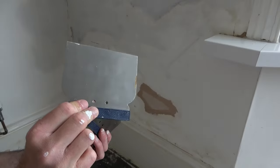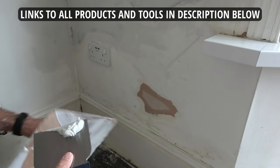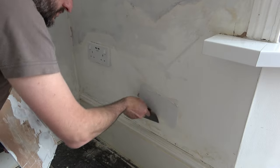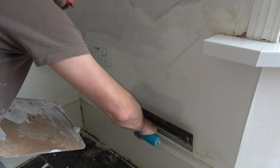If you've got a smaller patch of wall to repair then you can just use a smaller set of filler knives like these — I'll put a link to these in the description section below. You use these in very much the same way as the trowel, just removing the filler from the hawk and spreading it across your damaged section of wall. Again, your damaged section will ideally be narrower than the width of your filling knife so you can flatten the filler into the height of the painted surface on either side.